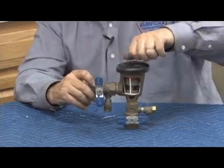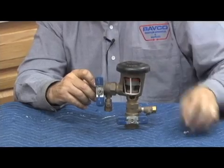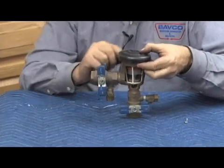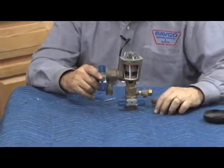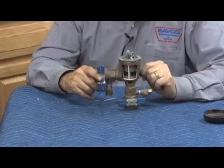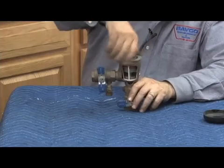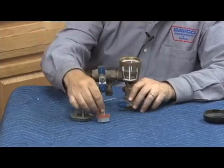To disassemble: one screw from the top removes the canopy. Canopies are an important part of all pressure vacuum breakers so things don't fall inside — yes, it acts as a drain or diverter for water when it first turns on, a splash guard, but make sure it's there so things don't fall inside. Once the canopy is off, the bonnet assembly will unscrew from the top, sealed by an O-ring. Underneath it will be our float assembly.